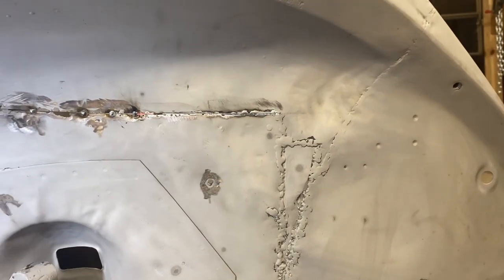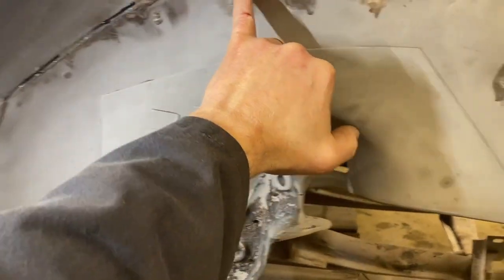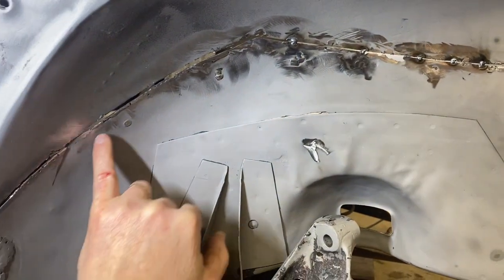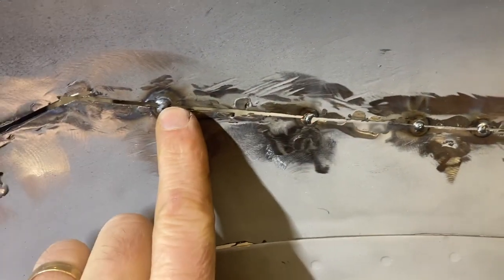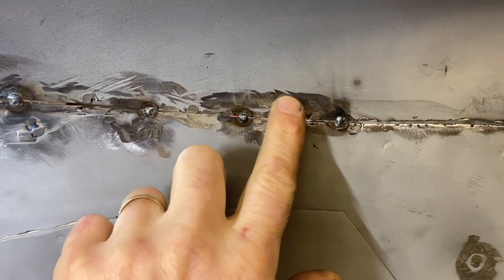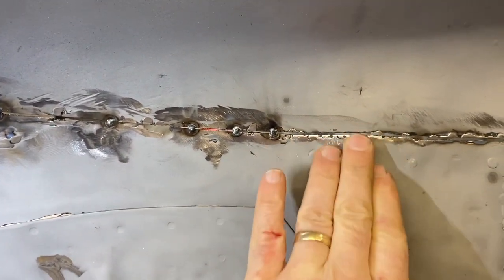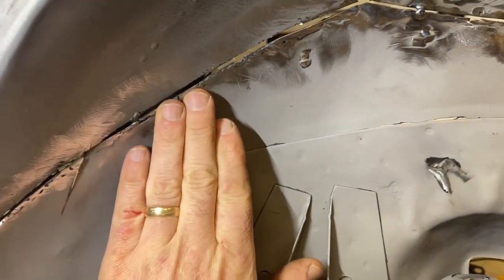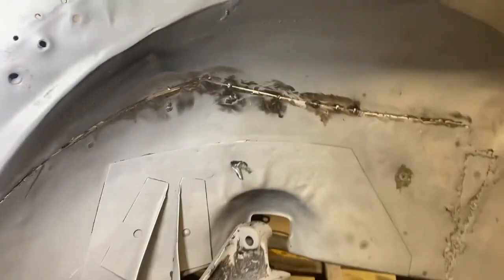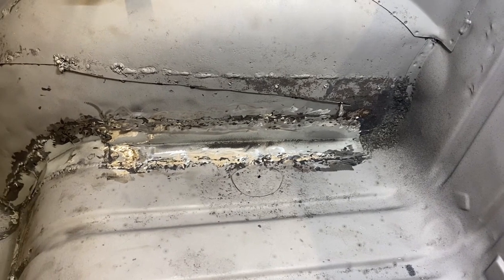It's Wednesday night, Third Stall night again. Dale and I are working on Hendrick. Last week we cut this welded joint. This week we're working on cleaning it up so that this surface is flush with that surface, then starting to tack weld it in place. I'm working my way down, trying to be as careful as I can to not thin out the material too much. As I tack weld it, I just use my body hammer and tap the two edges until they're flush. Then I'll work on stitch welding it all the way around — it's going to be a little harder on this curve, but I'm going to do my best to be methodical and careful about it.